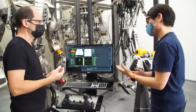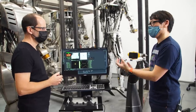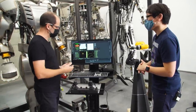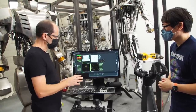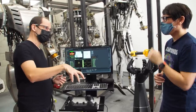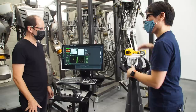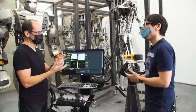It's a pre-calibrated system in the sense that the dot is the center of gravity for the object. The servos are the advanced kind that have feedback — that's making sure it goes where I'm telling it to go, but I have to tell it where to go, and in order to do that I have to know this information. The other interesting thing is that it works two ways — I can bypass the stabilization system and actually drive it. It's possible to take Axis 2, turn it over, and drive it around like a walking machine, because that same direction and heading works both ways — upside down and right side up. What I'd like to do in the future is get it to handle any irregular object, but for that I'm going to need force sensing on the fingertips. That's the next big step for me.